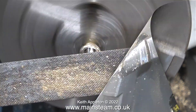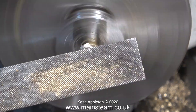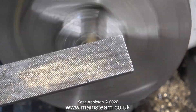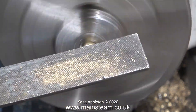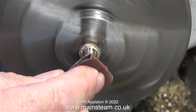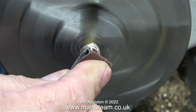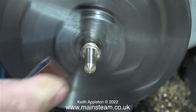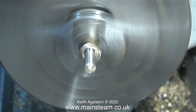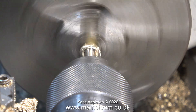I reduced the diameter of one end of this piece of brass bar down to about five sixteenths of an inch. The end of the bar was already rounded but I'm smoothing the round end first by using a file followed by some emery cloth. A couple of health and safety warnings here: when filing in the lathe make sure the file has a handle, and usually I would fold over the emery cloth so it's thicker. I didn't do that in this instance because the pressure on the work was very light.